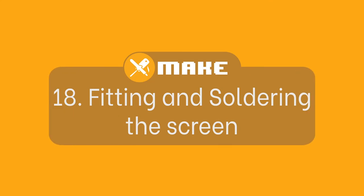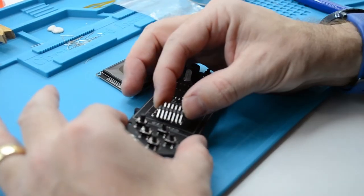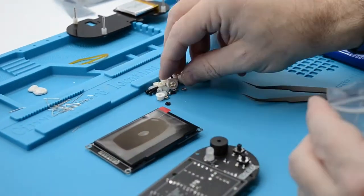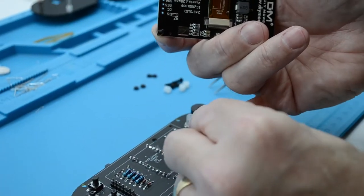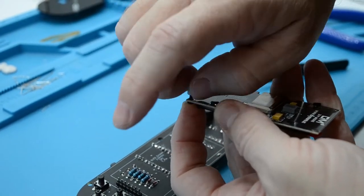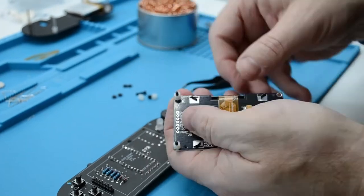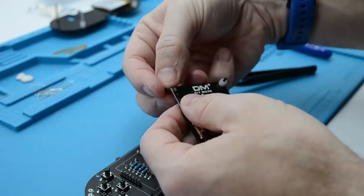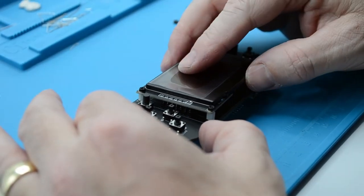Fitting and soldering the screen. Take your header pins and place the long side into the holes on the front of the PCB. Do not solder this in yet. You will also need your black nylon screws and white 4mm spacers. Take your screen and nylon screws and push the screws through so the thread is pointing out on the bottom side of the screen where the ribbon is. Secure the bolts in place with the 4mm white spacers, and go ahead and secure each screw with a spacer. Place the screen assembly into the PCB holes — it should snap into place. Make sure to align the header pins with the holes in the screen when you fit it on.